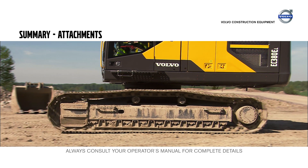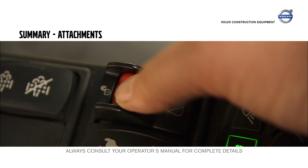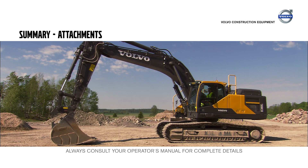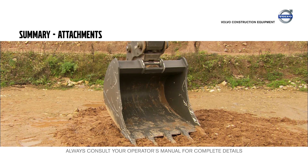Place the machine on a flat surface. Press the safety switch in the cab to release the attachment. Use the open bucket maneuver to disconnect the attachment. Make a back hand test to ensure that the attachment is secure.